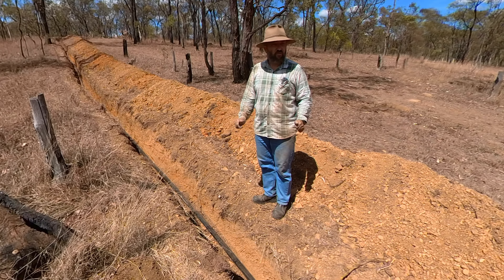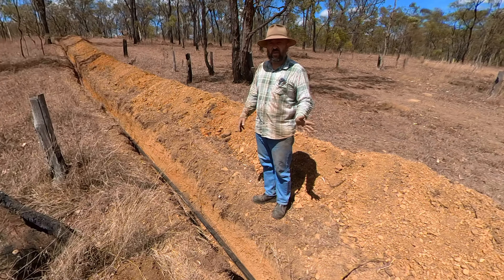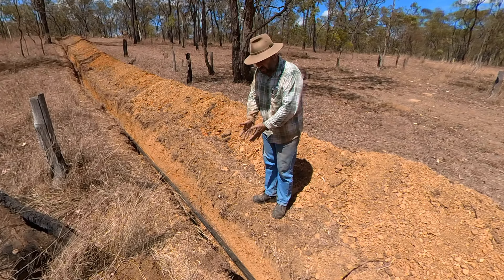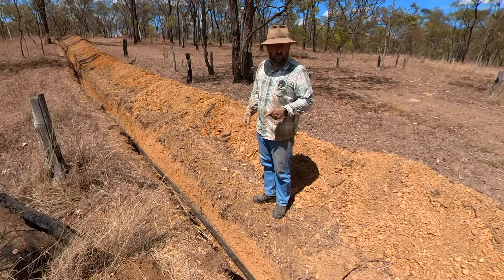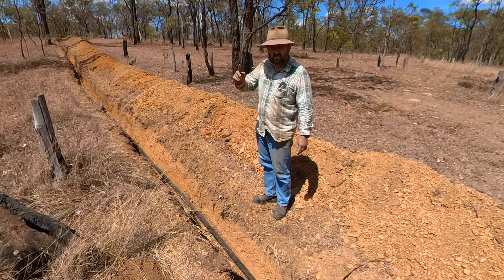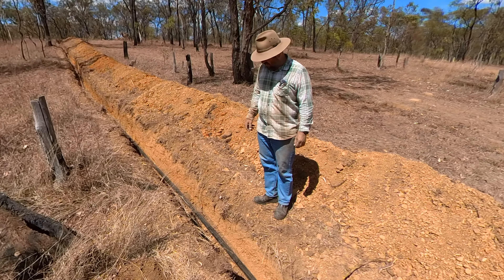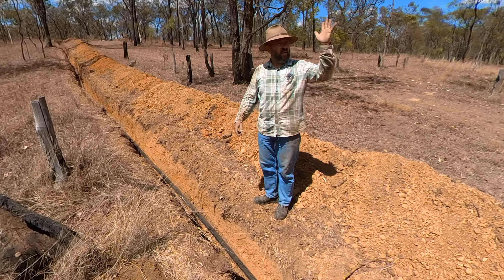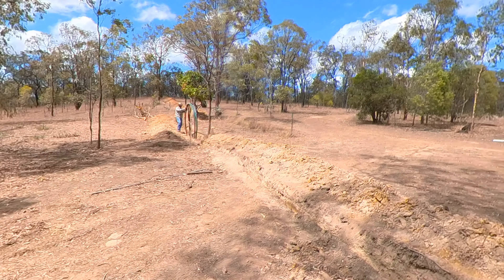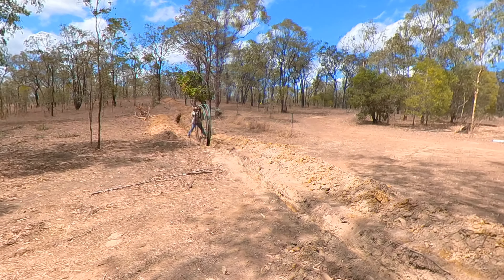Two people, maybe three — piece of cake. You can do it too. In here I'm going to put a junction box or tap box. I'll put a tee piece in with a tap and just bung it off temporarily for now. That's for our future shelter down the hill, and then after the tee piece I'm going to have another tap for the shack. It might seem like overkill having a tap here and a tap there, but once we've got our shelter up and running, we don't want water pressure down there all the time — it's just another failure point.